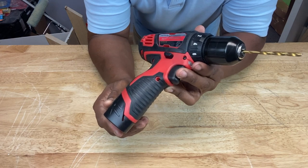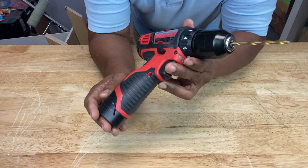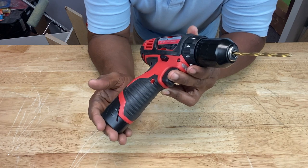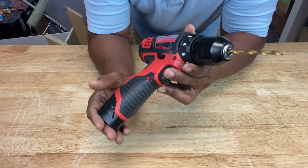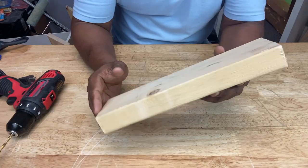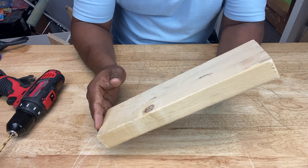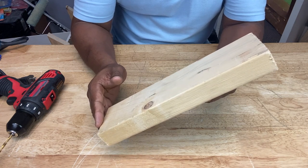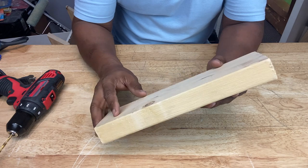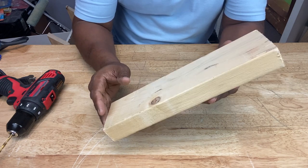If you're using a cordless drill, it could also be the fact that your battery is low. You can tell when the drill is losing power because it starts to slow down and doesn't penetrate what it should, like wood or drywall. There's a caveat to that — all wood is not created equal. Some are more dense than others, depending on the age of the wood, the chemical composition, and the way it was processed.